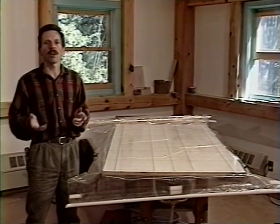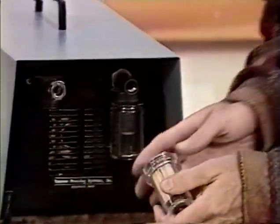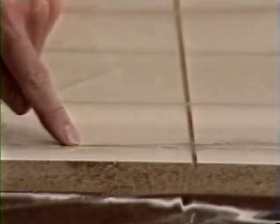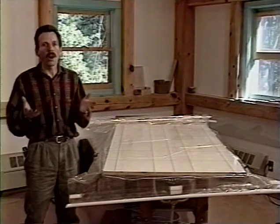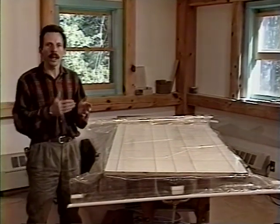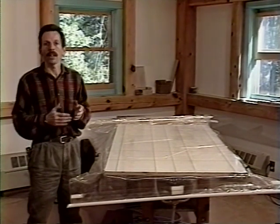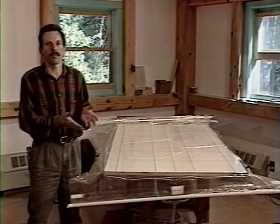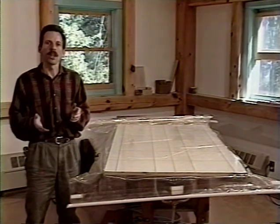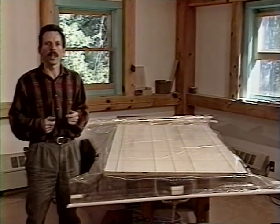This same scenario can be caused by a clogged filter jar, as well as glue filling up the grooves in the platen right around the exit hole, or anything else that does not allow the air to get out of the bag quickly and efficiently. Like a sealed form with air trapped inside. This may never happen to you, but if it does, you'll have a clue about what's going on.